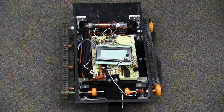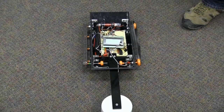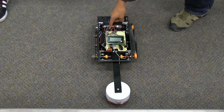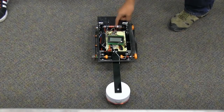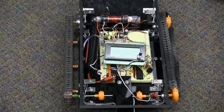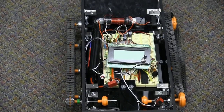When the front coil detects metal, it's going to change the frequency — it'll be a higher frequency. We have a filter here to pass the higher frequencies, and then another filter that converts the frequency into a DC voltage.